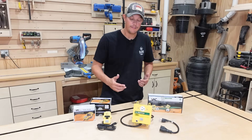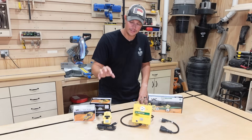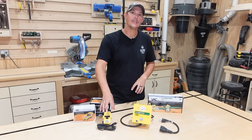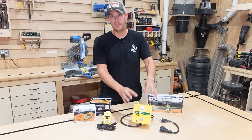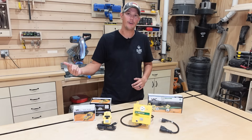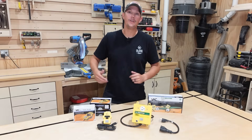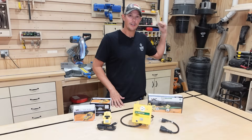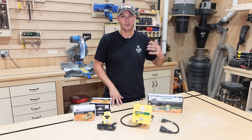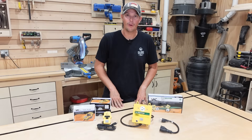Essentially the way this works: it gives you a wall-mounted on/off button, but we're also going to attach the Tool Plus sensor to the power cord of whatever tool we want to activate the dust collection. This is going to send out an RF signal that is received by the wall-mounted box, which the dust collector is plugged into. As soon as the Tool Plus senses the tool has been turned on, it sends that signal and tells the box to turn on the dust collection automatically. When you turn the tool off, it sends another signal to turn the dust collector off. It also has programmable delay times — you can set the dust collector to run an extra 5, 10, or 15 seconds after you turn the tool off, just to clear out the ducts.